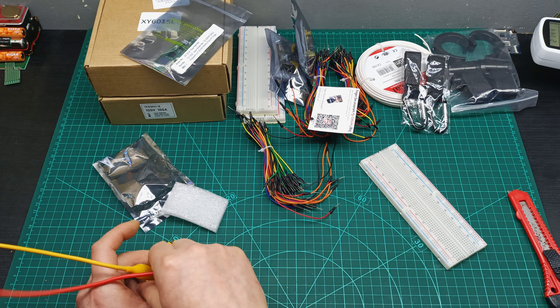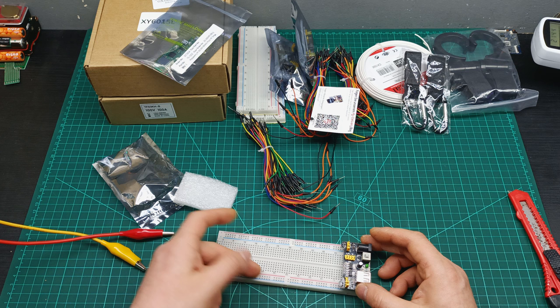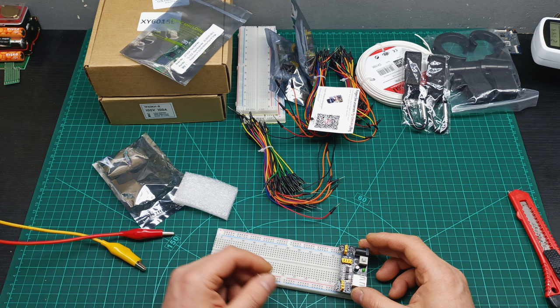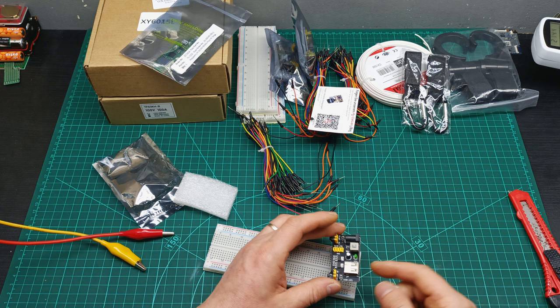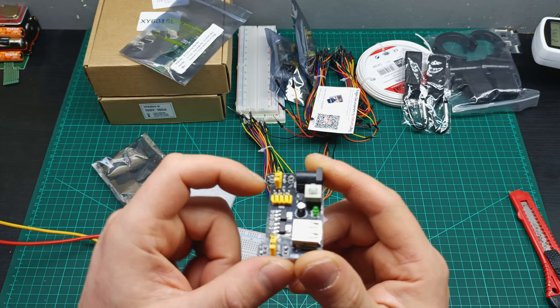So yeah, the power supplies are good and are really very useful and very easy to use, because when you do some projects on a PCB board, you just plug them in and then you have 12 volts here and you have 5 volts and 3.3 volts if you are working with the ESPs, because they are powered at 3.3 volts. And also you can power 5 volts over here, but if you power 5 volts over here, you will not have enough power for the regulators, because the regulators here, one is the 5 volts and one is the 3.3, need more than 5 volts in order to regulate the voltage again. So I recommend when you use this one to power from here.